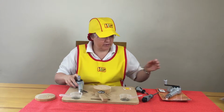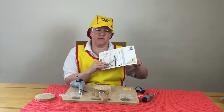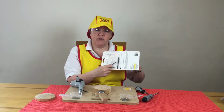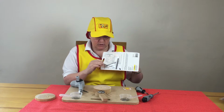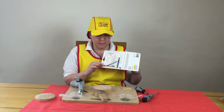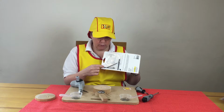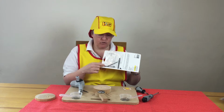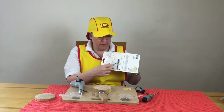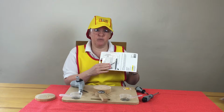In your drill set that comes in your tinkering kit, you get 3 different sizes of drills. The reason there are 3 different sizes is the smaller the size of drill, the easier it is to make the hole. And so if you want a large hole, it's usual to do what we would call a pilot hole. You'll drill with a smaller drill to start with, and then the bigger drill can follow that hole through the piece of wood, making it much more simple.